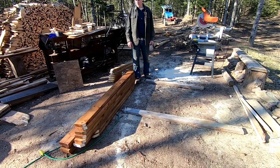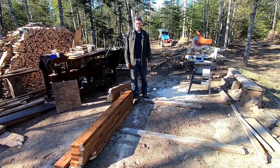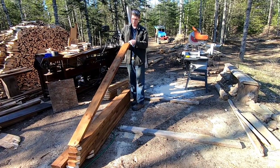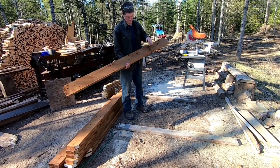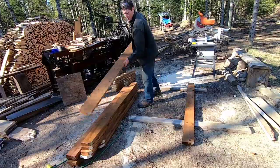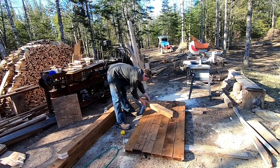We're going to start laying out the tabletop. I've leveled up two pieces of board in the driveway — sometimes we have a nicer setup in a shop, but for now this will work. The ones that I cut the inch-and-a-half 45 out of will be our two outside pieces. I like to make sure the nicer side goes face down, because the down side will actually end up being the top of our table. Now I'm going to start laying out the legs — we need two of each leg.